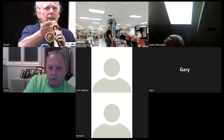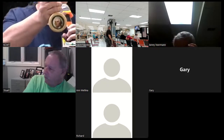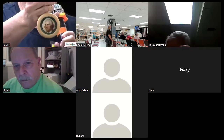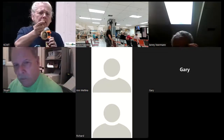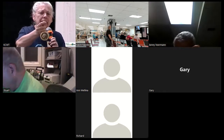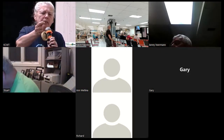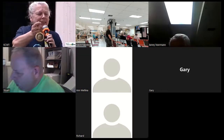This one's ash, turned from a baseball bat blank. Normally you expect the iridescent paints to need a black background, but I just put it directly on the sanding sealer on the ash and it came out looking quite gold. Then I painted on top of it and I was not impressed with the effects, and I would not paint it again.